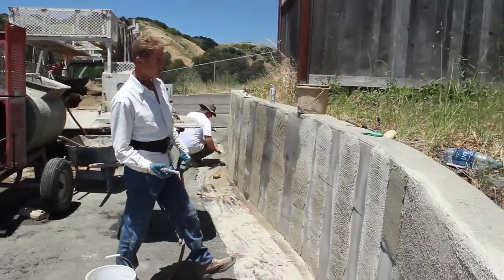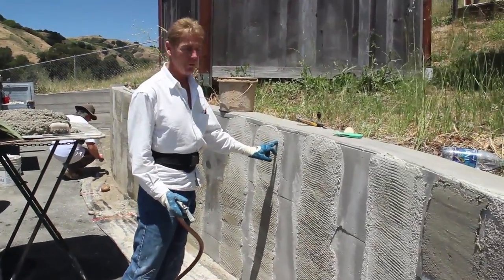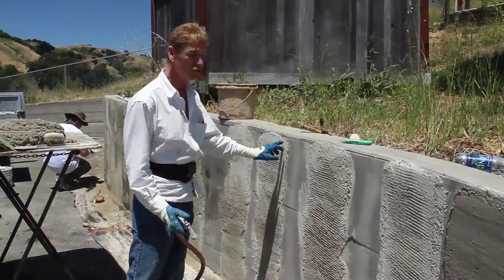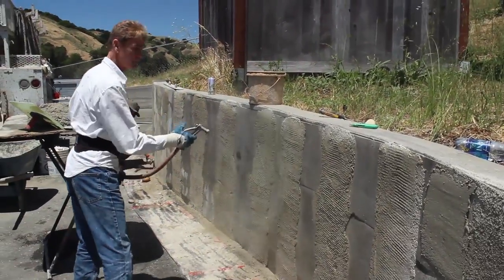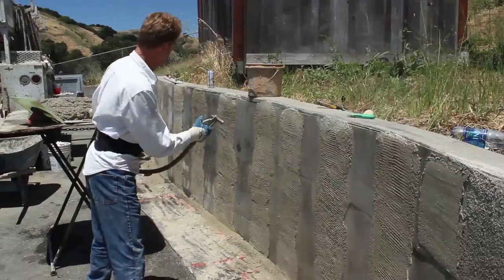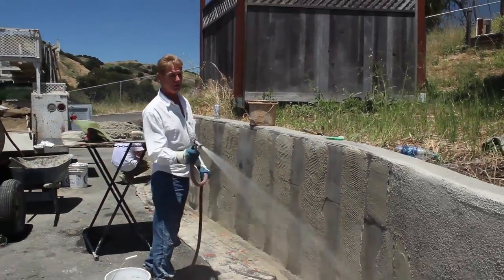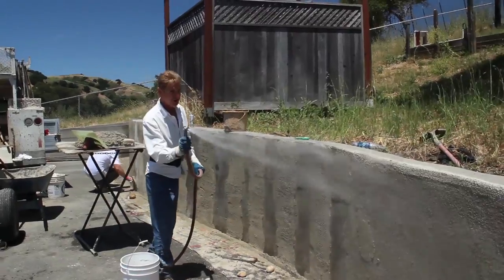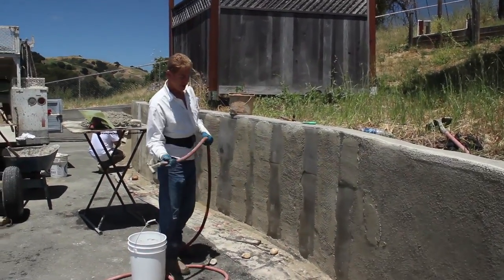All right. Okay, guys, with this Eisenwall product, it finally turned tan right now. It's drying up. That's an inch thick. What I did was I made a little mistake, and right where you're at, Jay, with this product, you always have to mist the walls too. You mist before and you mist after for the mechanical bond.